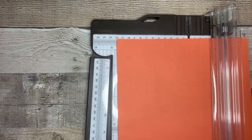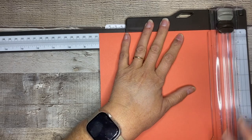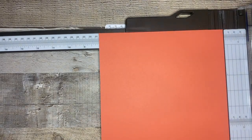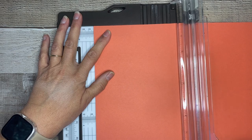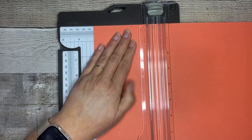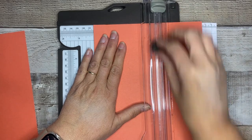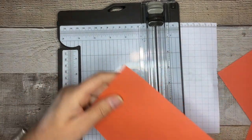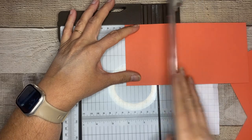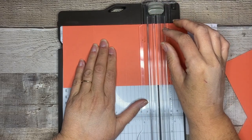Pull the arm out so you can cut the full sheet — cut eight inches — then get the arm out of the way and turn it and cut two pieces four inches wide: one and two. So two pieces, four by eight. Then you're going to score each piece at two inches, four inches, and six inches. You're going to do that for both pieces.